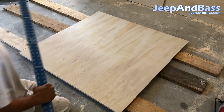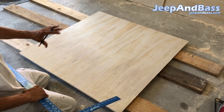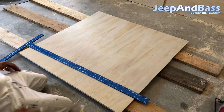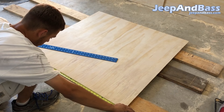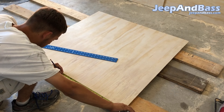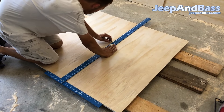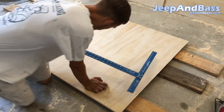This is the last layer of the roof I've got to put in and it's going to be stained, so I want it to look nice. Before, I didn't really care too much about the pattern of screws, but now I'm going to make a grid so it looks more presentable. I'll find the center on this piece — center is going to be 21 and a half. I'm going to put a row of screws on the center. I use pencil because it's going to be stained — I have to draw really lightly so I can sand that off. Just barely visible.